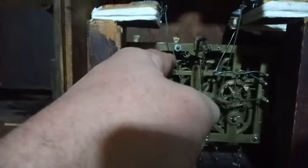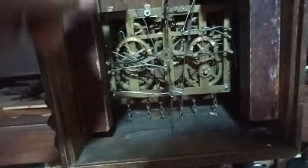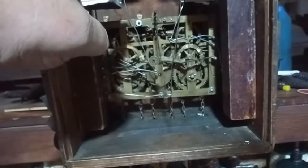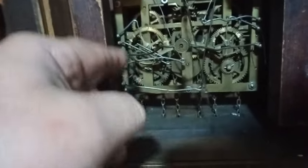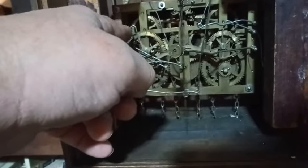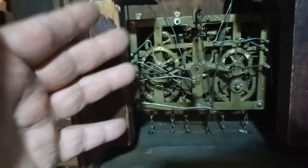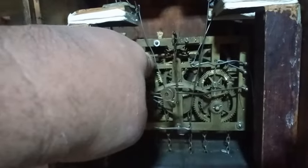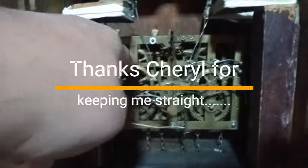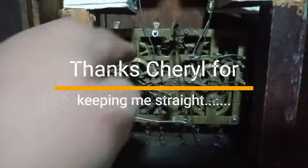The third wheel warning wheel has two pins. However, one is on the inside going toward the front, and that's the pin that catches the lever and everything when it all stops cuckooing. Then this pin is what stops the cuckoo from cuckooing when the quail is doing its thing.